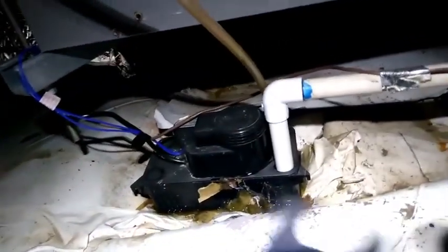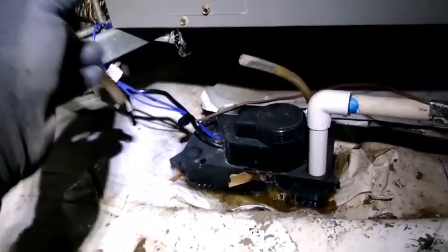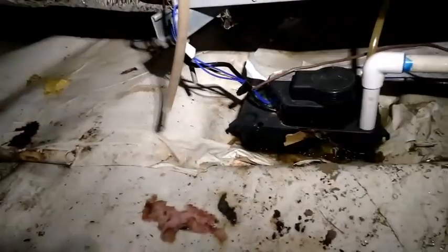Super, so let me take a look in this thing, see if it's going to pump or not here. And we started pumping, it pumped all the contents out. So we had to see what happens with this line, wherever it goes, see why it's blocked up. I tried to hook up the Mighty Pump and kind of stuff my glove in with it to suck this thing out, but it wouldn't really work because it wasn't a good fit. So I took the nitrogen and evidently that worked because I blew crap all over the place. Yeah, that worked. There was something caught in there for sure.